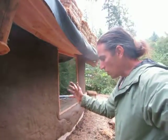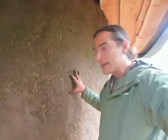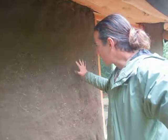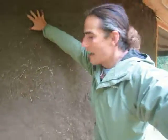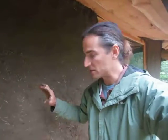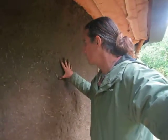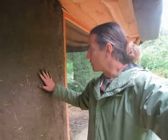This wall is drying and curing. When it dries, this color will lighten up. All of that straw woven together is stuck to the straw that's woven throughout, and it becomes monolithic — it's one unit. So this wall becomes super strong. That's the lateral strength of the building.